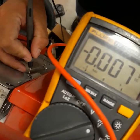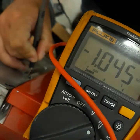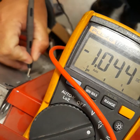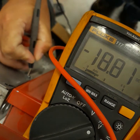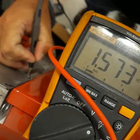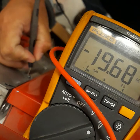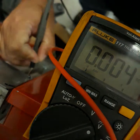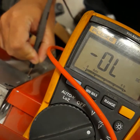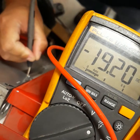That's DC voltage. You can see it's one volt on the first leg of output number four, 18 on the second leg of output number four. Next leg: 1.5. Next leg — output number three — 19. Then we go down here and get 0.004, so no voltage on that one.